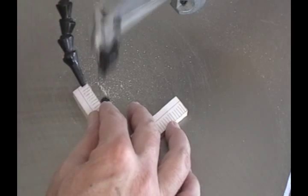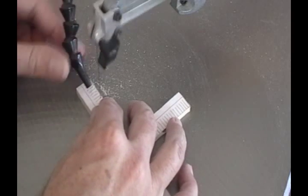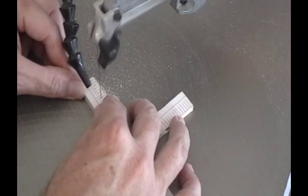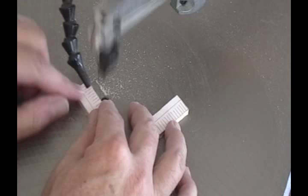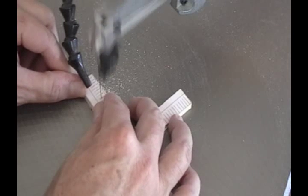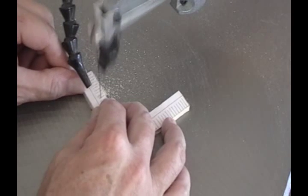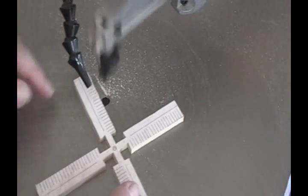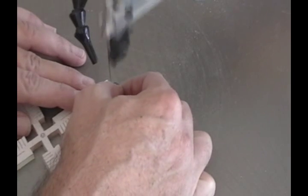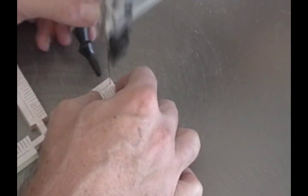This little black thing has a pump inside that shoots air. At lower speeds it doesn't work so well, but you've just got to get it in the right spot. You tend to collect all this fine sawdust as you're cutting and it piles up, and you lose sight of your blade — you don't want to lose sight of your blade. I'm going to slow the speed down just a little bit and get the air blower positioned so it keeps that dust away. I want to be very precise here.